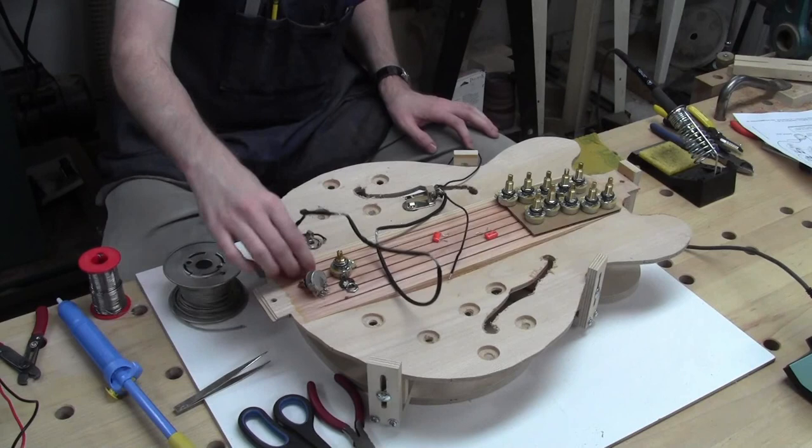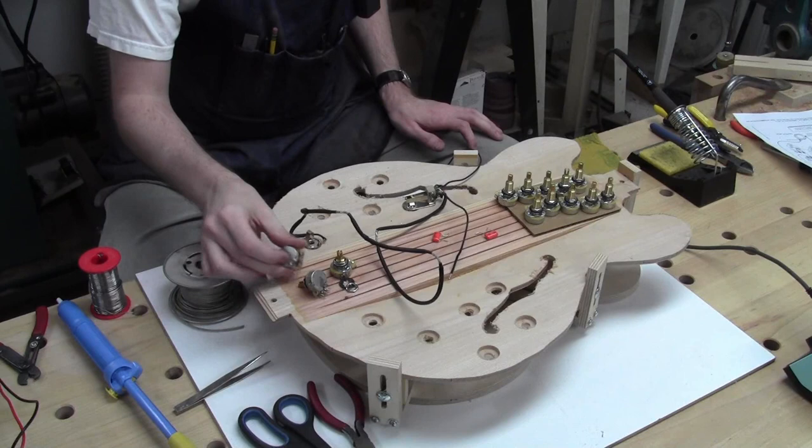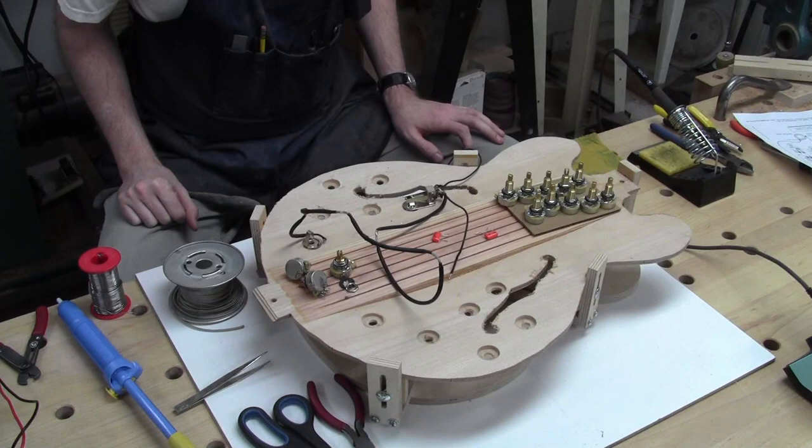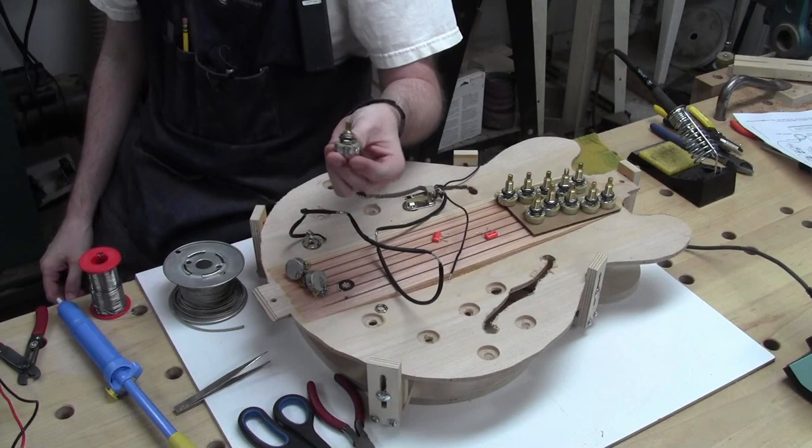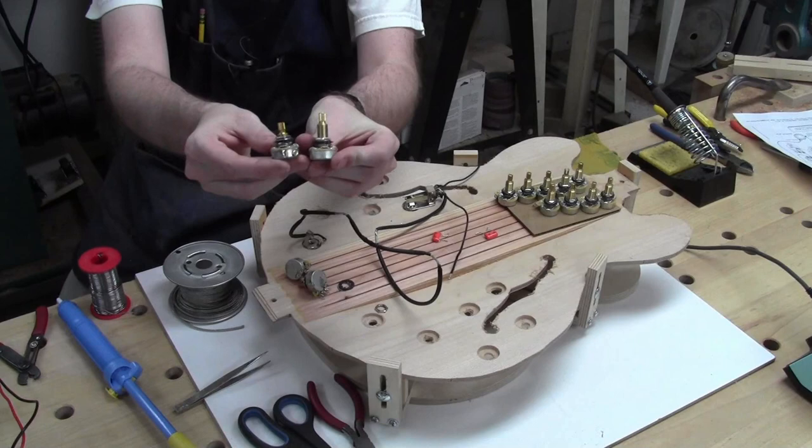So what's the recap? I destroyed at least one of these potentiometers, and so I ordered some more. I'm a little disappointed — kind of annoyed at StewMac actually. These look like short potentiometers and these look like long ones. There are basically two that are common: three-eighths and three-quarters — the length of the shaft.